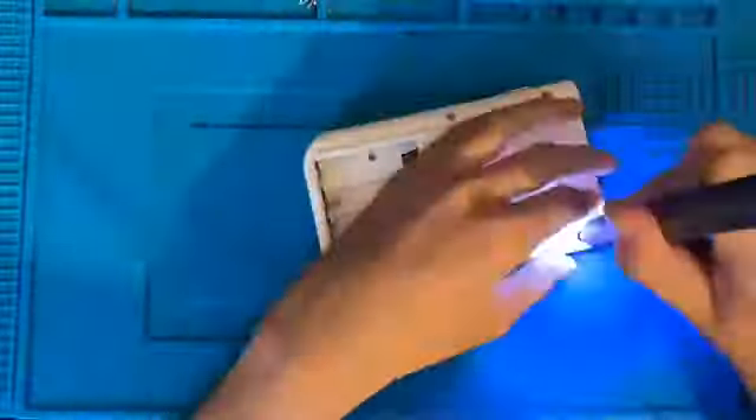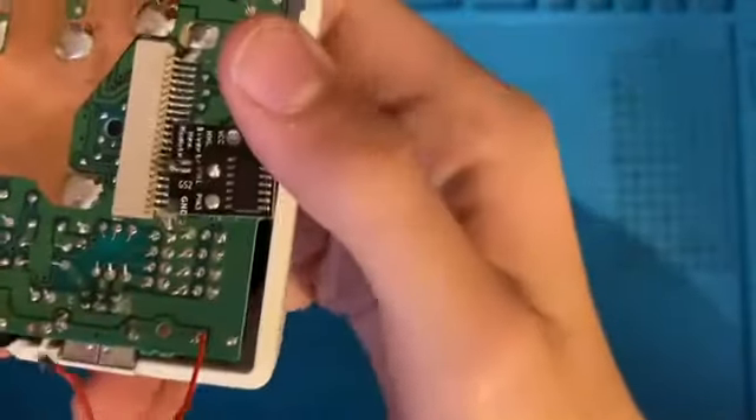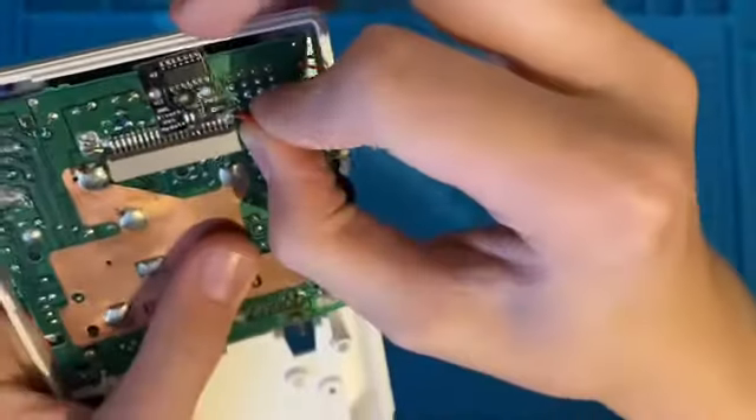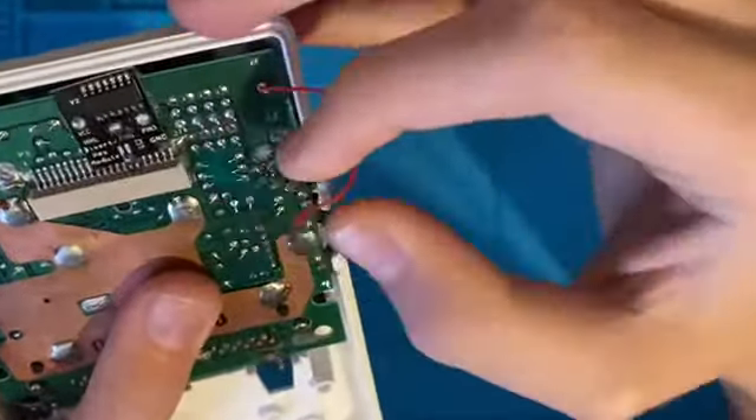Still need to take it apart and turn the polarizer film. I don't know if it's an adhesive one — if it is one of the sticky ones, I have a spare to put in it. The ground wire isn't attached, and the whole chip is wonky. The two pins are shorted as well. That ground pad hasn't just not been soldered in — it's been soldered in and then torn off.